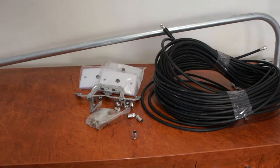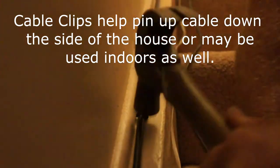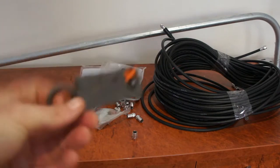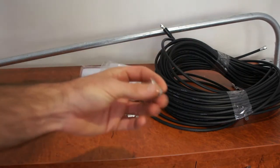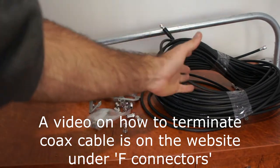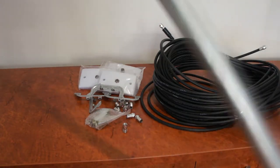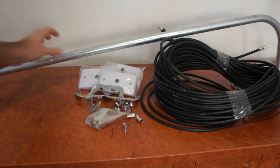What a lot of other people may buy, but you may not need, is a bag of cable clips. We have them at a really good price for $8 a bag — you'd spend $20 if you go to Bunnings. You don't need these, but coax strippers and a crimping tool are available to help you put these connectors on the coax cable. If you're not sure about how to do that, we have videos on how to put these connectors on your coax cable on the website, under F connectors and wall plates. An alternative to the mounting pole or the J-bar — you may want to get what's known as a tripod.